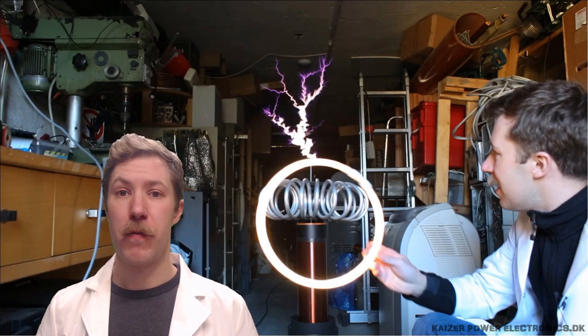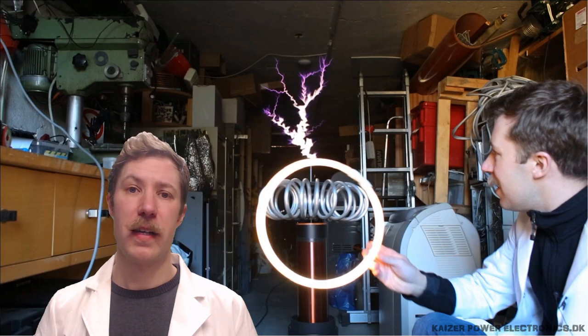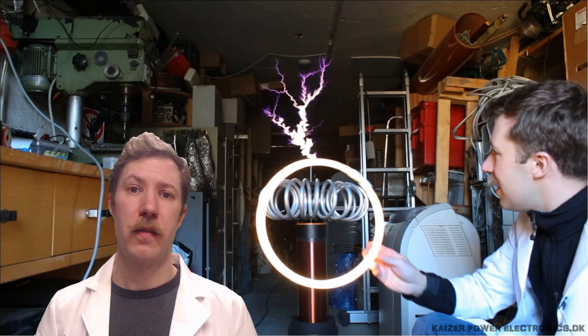In this video I have recorded some high-speed photography of this Tesla coil. It is a quasi-resonant solid-state Tesla coil, which means it runs with very long on times that is synced to the mains sine wave envelope.